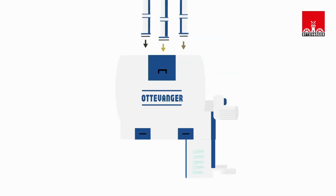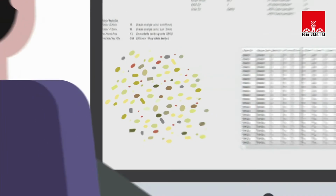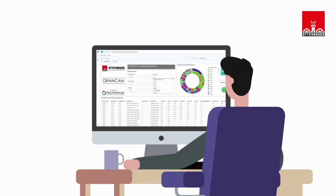And after discussions with Wouter, sitting together with him, we were also looking at possibilities in our industry. And the first thing we did was focusing on grinding, because controlling the particle size or particle size distribution is quite important in our industry. If you can measure this online and control your system, adjust your grinding online, your hammer mill for instance, or your roller mill, you can immediately respond and improve your process.